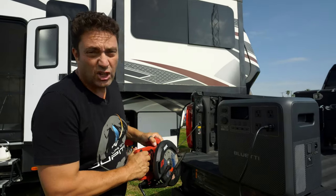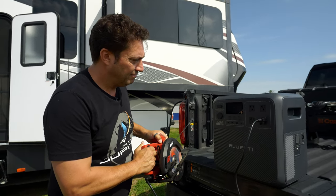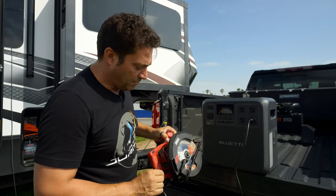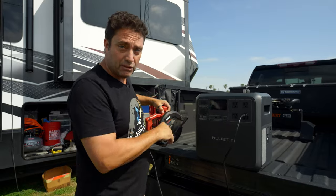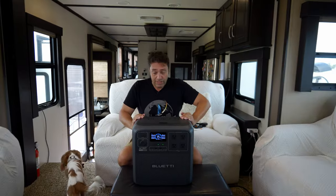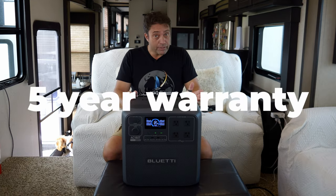Let's check the power saw — not under load, just rolling. It started at 1500 watts, which is an inductive load rather than a resistive one. As long as it stays under 1800 watts, this unit will run it. And this Bluetti unit, like all the Bluetti stuff I've seen so far, is really nice quality.